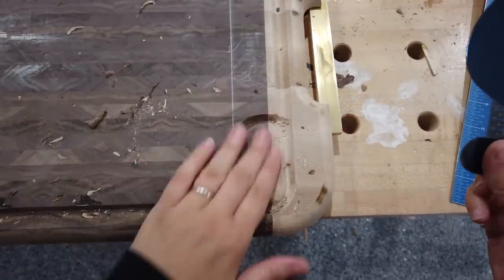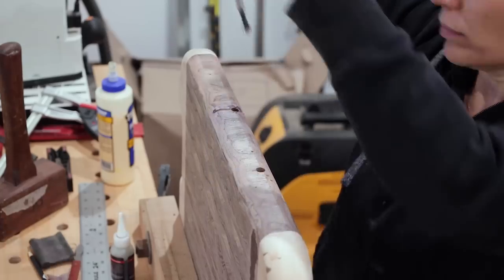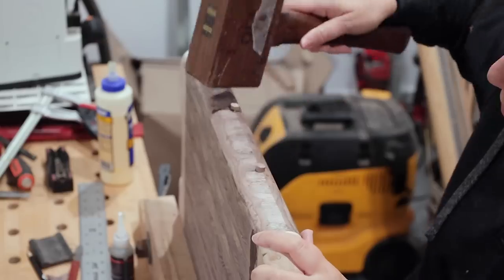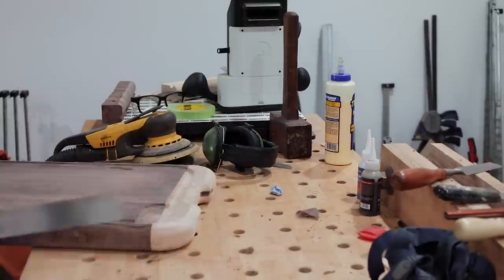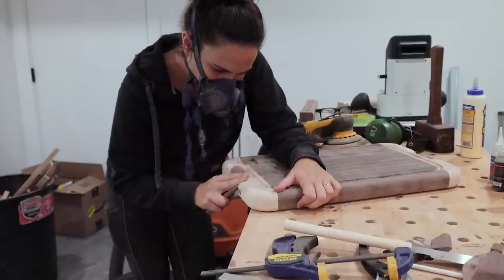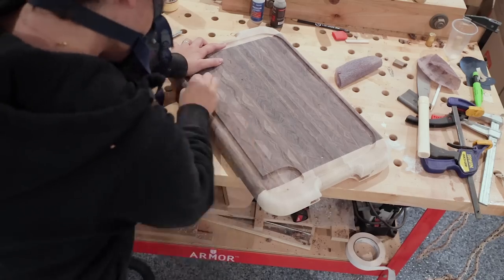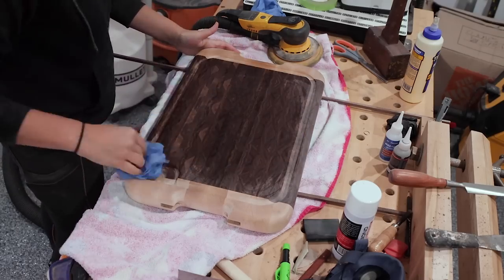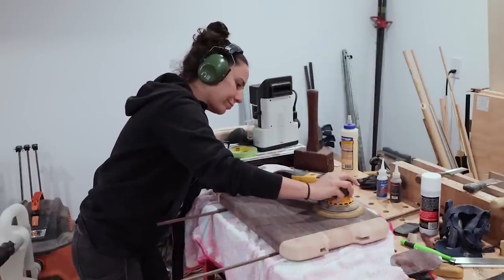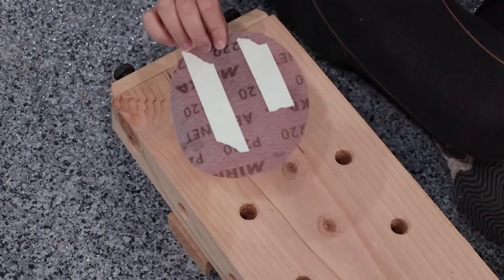Since all this material was salvaged from my failed roll-up chair there were holes to fill and imperfections to address — which I probably should have done when the board was still square, but it still worked. I made some walnut plugs, glued them in, and cut them flush. Then I sanded for hours and hours, contemplating all my life decisions like adding those curves on the inside of the handles. I sanded up to 320, raised the grain with a wet rag, waited for it to dry, and sanded with a final grit of 400.